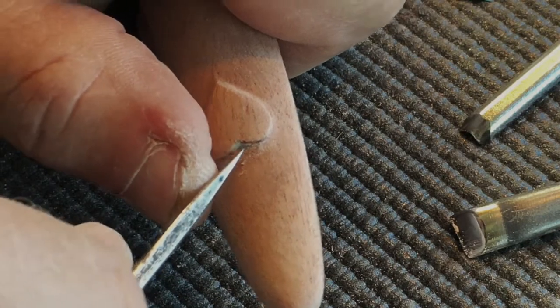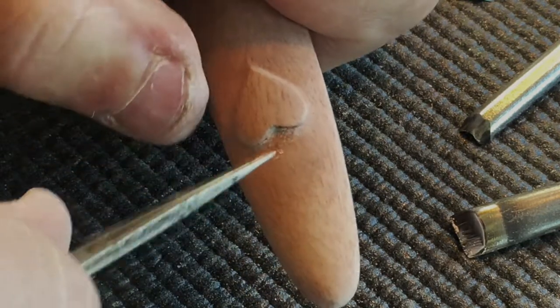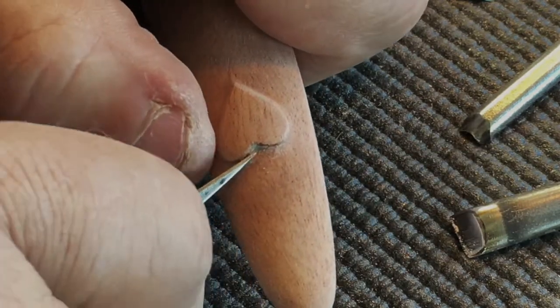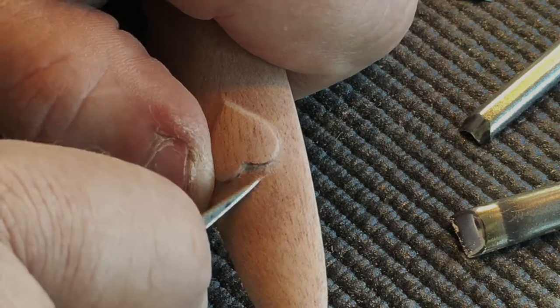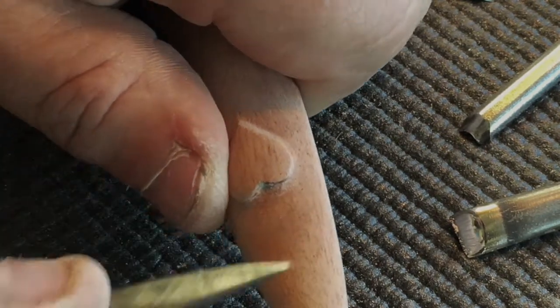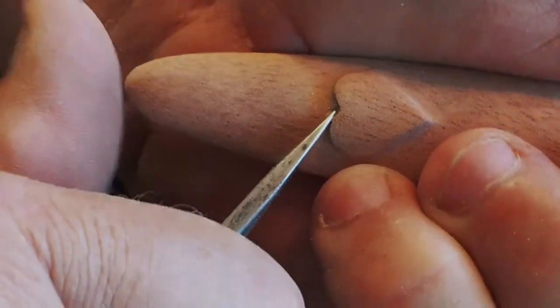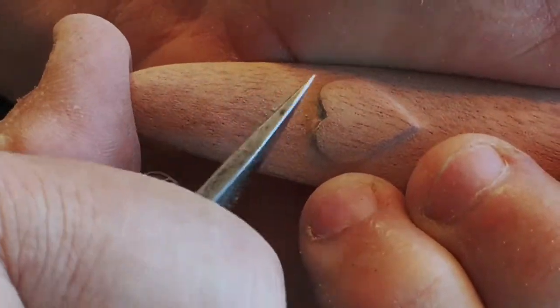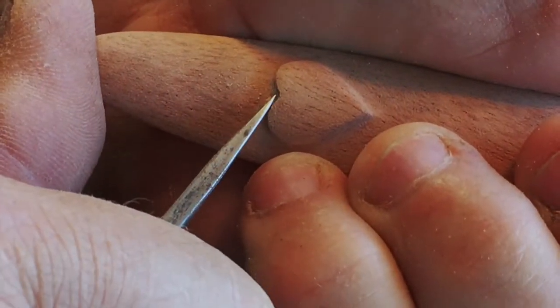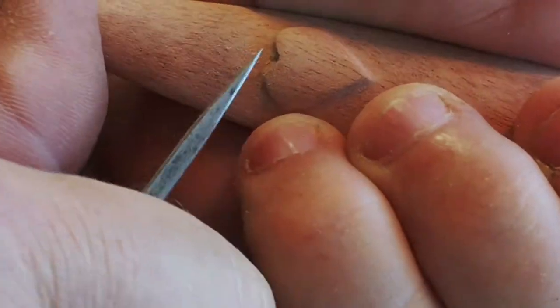Notice this flat area above the heart on the handle — notice how smooth it remains as I scrape and remove material from the surface. That's important because I've already shaped this handle and it has a nice gradual arc all the way from the bowl of the spoon to the very end of the handle, and I don't want to change that. I just want to blend into it seamlessly.